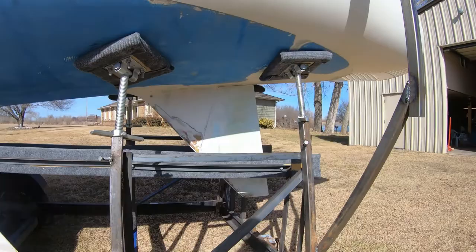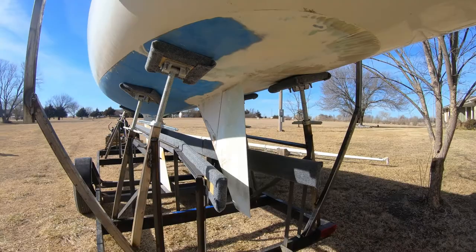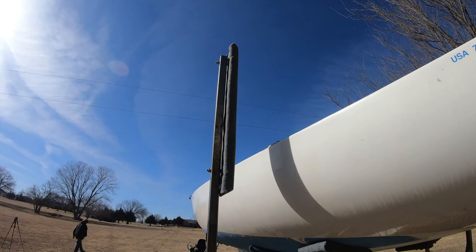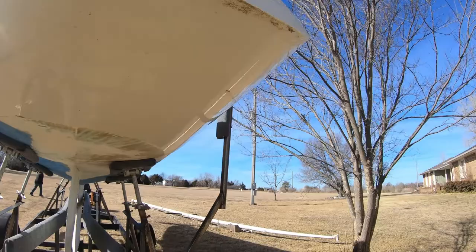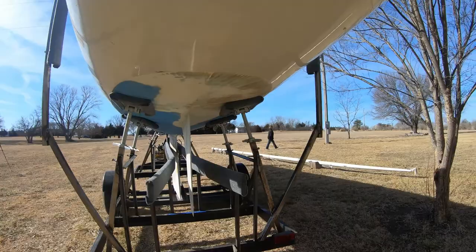In order to help hit that narrow keel guide, we put a V back here and this will help. But that V is going to be a long ways underwater when you're launching this boat, and so will these pads up here. So in order to be able to see the trailer and line up with that keel guide while it's underwater, we added these hull guides on the side. The distance between the hull guide pads is one inch wider on each side than the widest part of the boat, so that'll line it right up with the keel guide and just slide right in there.